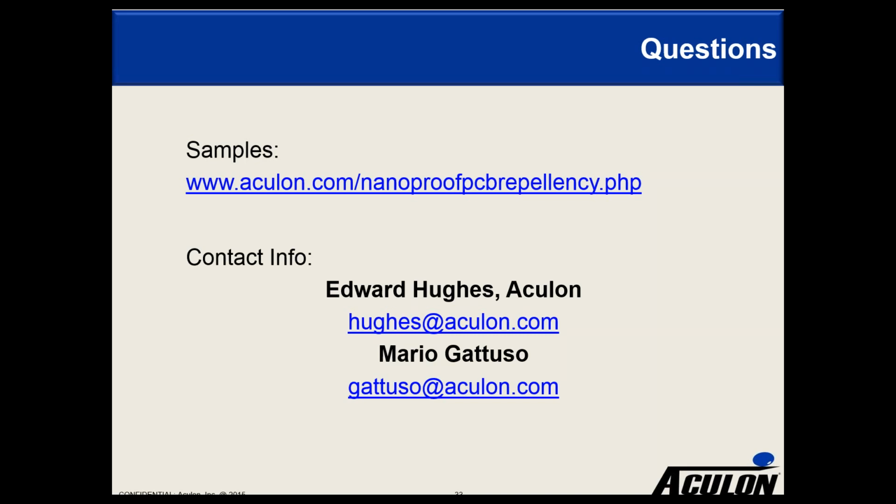Okay, thank you, Eric. Do any of the NanoProof options require special spray equipment, and can we use our existing spray systems for coating acrylic conformal coatings? You should be able to use the existing equipment. Most of these materials are essentially designed to be used in the standard kind of spray equipment, like Asymtek style machines. We've tested it with HVLP sprayers here, not really ideal, air-driven sprayers are not really ideal, but if you've already got acrylic conformal spraying equipment, it should go in easily.